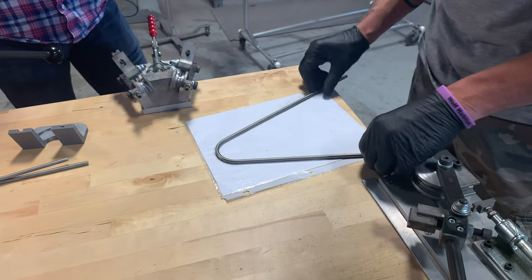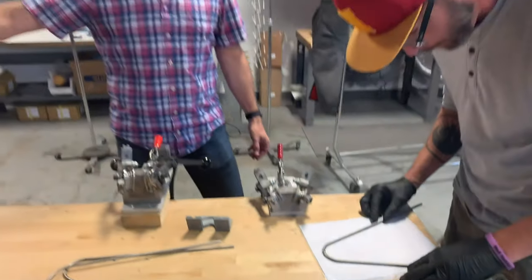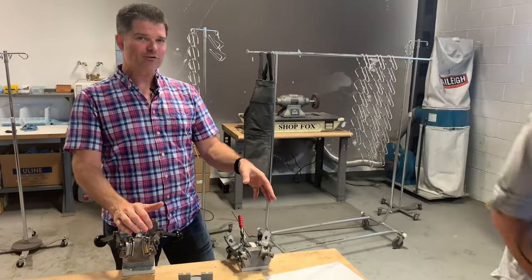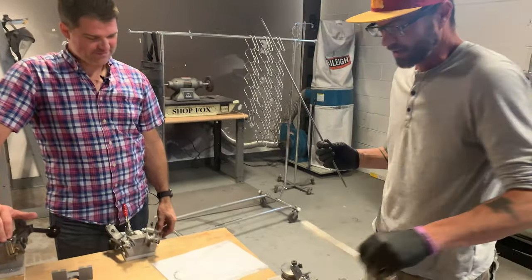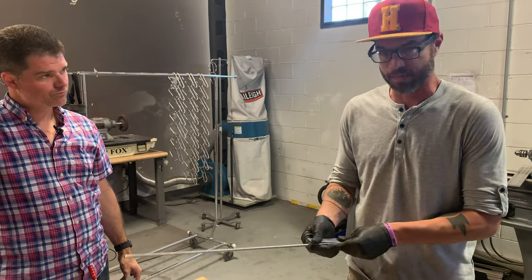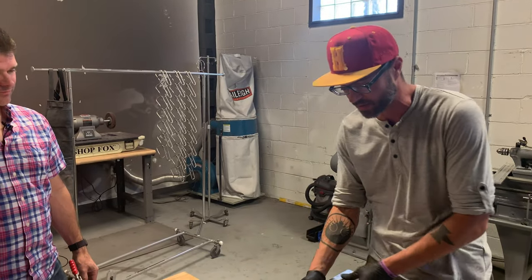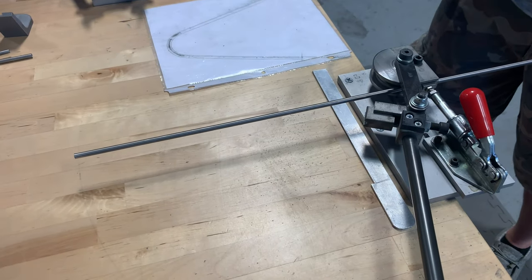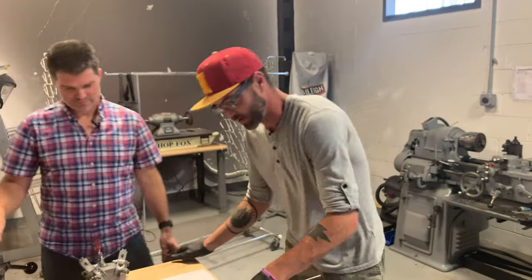All the way through the process, our total tolerance stack-up is 0.15 millimeters at the faces. There are quite literally probably ten thousand ways to do it wrong, and there's really one way to do it right. If they're not in tolerance, we've found that we'll get defects with the bend. And as Josh said, the spec is so small that anything out of tolerance just compounds as you keep going — it's simply not going to work.